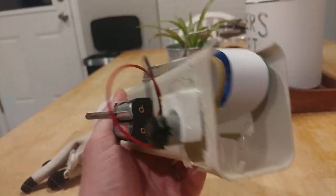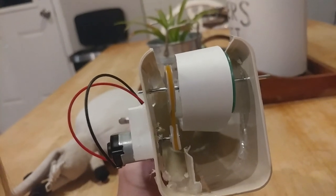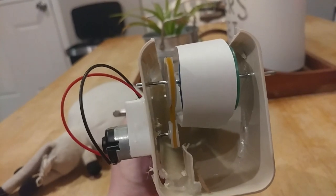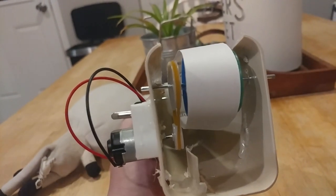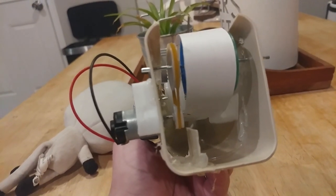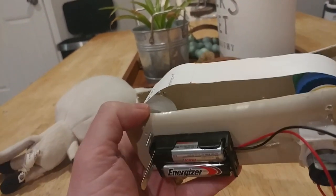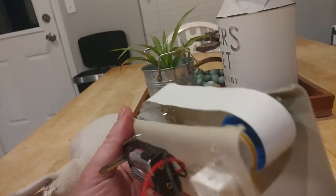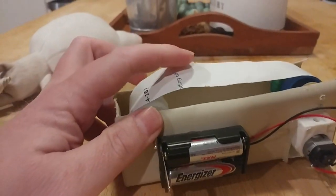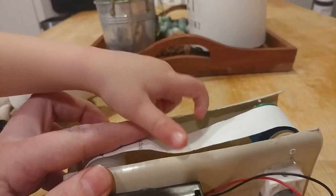For starters, the motor was originally too low, which was creating too much tension from the rubber band between both pulleys. And the rubber band would pop off when the motor was kind of canted, right? We also learned that the spacing of our pulleys is equally important. And lastly, how tight our belt is between the pulleys is equally important.